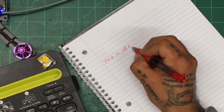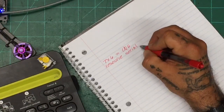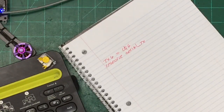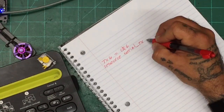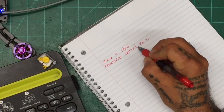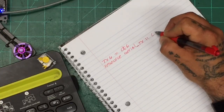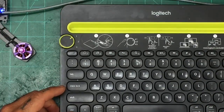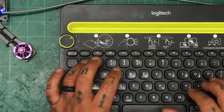Now we want to assign soft serial to that address. When you use soft serial, there's an additional '1' put in front of the number — so soft serial TX 1 becomes '1 1' instead of just '1'. The difference between serial TX 1 and soft serial TX 1 is that you'll have '1 1' for soft serial. So the command is: resource serial_TX 1 1 C06 — then press Enter.